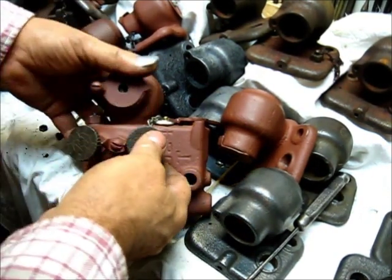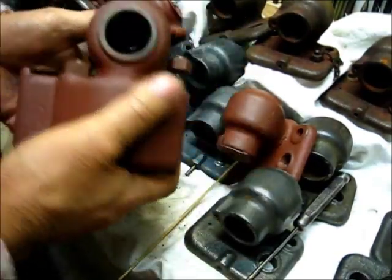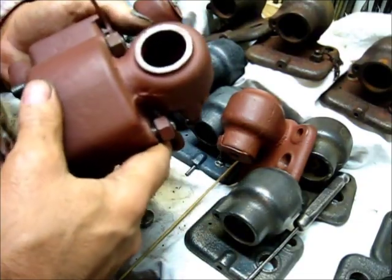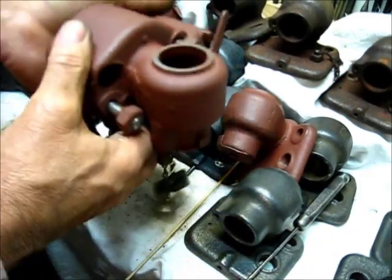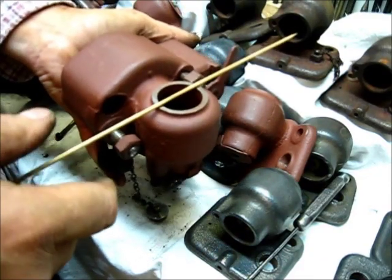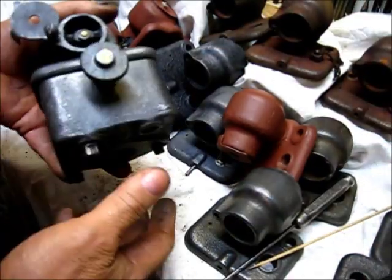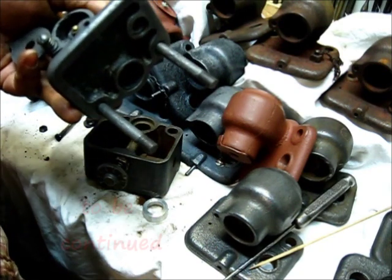Let's get on to the seats — we've got quite a few of them to do. I'm going to do this one here; it's the same procedure. I'm not going to do every one, only going to do one over there on the miller machine as an example. To explain: you would set it on an angle plate on the table and indicate the top of this area right here true with a dial indicator, indicate it level. Now let's get over to the miller machine and get this done.